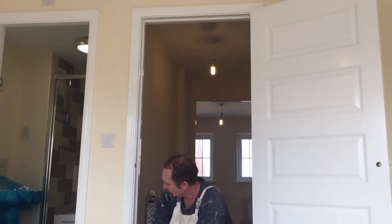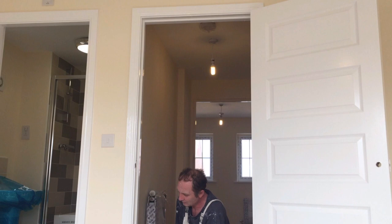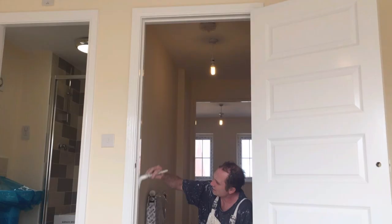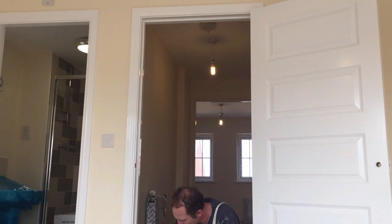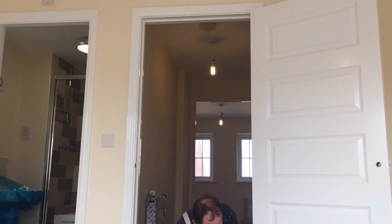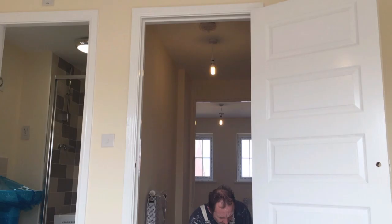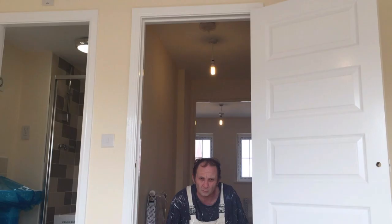Two coats of satin. Mind you, you get a really good finish if you put two glosses on the frame as well, so you can imagine how smooth it is and what a good finish you get by putting two coats on. When you're painting near the bottom of the frame, especially on the second coat, you don't need to hit the floor or get right to the very bottom. You can come up by a couple of mils so you're not touching the floor with your brush.